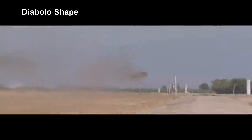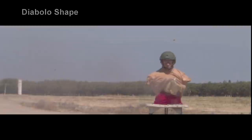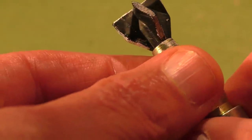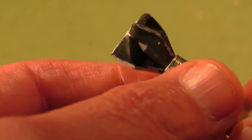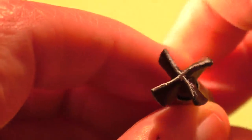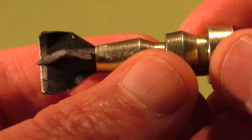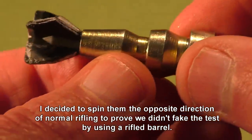The Diablo shape works perfectly fine at supersonic speeds without any spin at all. So we have to ask ourselves: what advantage will we have if we angle the fins on a fin-stabilized projectile? It's already fin-stabilized, so is adding spin stabilization just redundant — an oxymoron? I put a pretty aggressive twist on these things — about a 40 degree angle — and as this thing is flying through the air, it should be spinning counterclockwise looking from the rear, or anticlockwise if you're British.